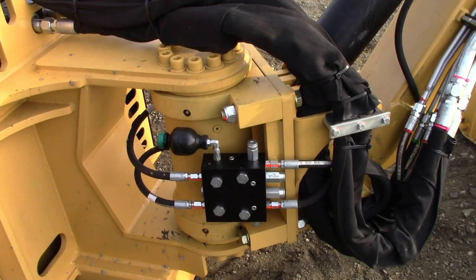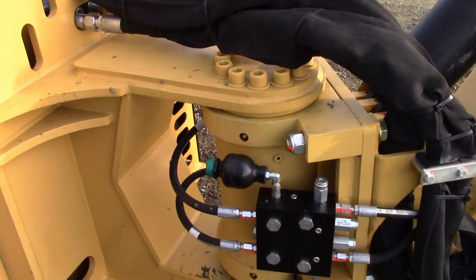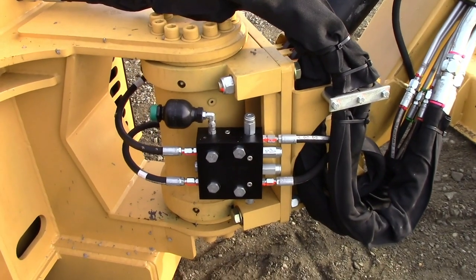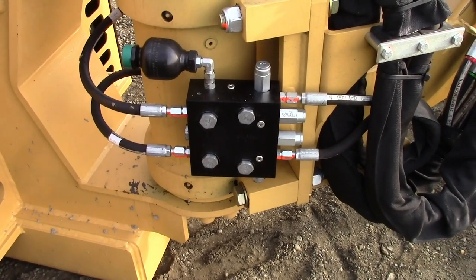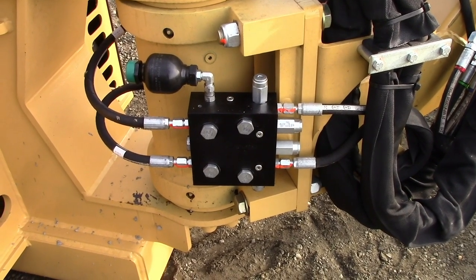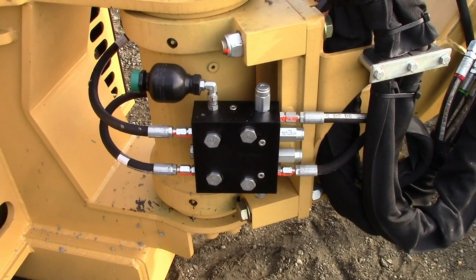Out here on the left-hand side we have our actuator — a mechanism that swings the boom forward and backward with a range of 180 degrees. There are grease fittings on the top and bottom; grease those once a week until grease purges from the purge ports on the other side. This is our anti-cavitation manifold, which provides the breakaway function. If you hit something solid, it allows the boom to safely break away in either direction without damaging the actuator. Keep in mind that continually running into things will cause damage over time, so don't do it on purpose.